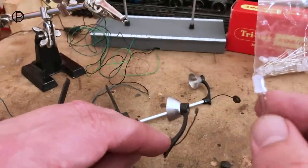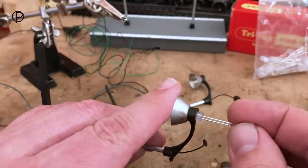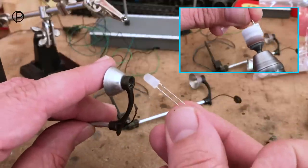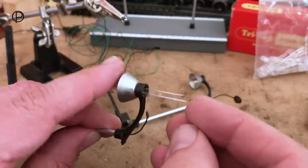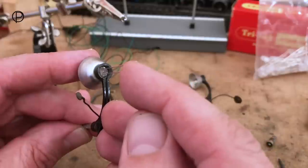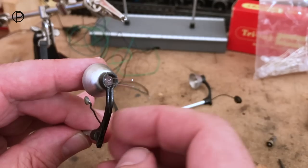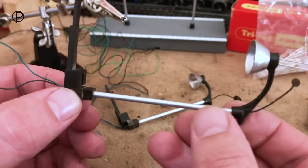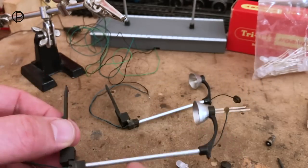The LEDs are little five-millimetre clear white ones — you could use cool or warm. When you push them in they don't quite fit, so you do have to do a little bit of work. I've used a rotary tool and taken a little bit off until they fit in nicely and snugly. Then we're going to cut these so we're able to solder the long positive leg, and we're going to bend the short one so it makes contact with the housing to get that return path all the way down the shaft to the green wire which makes contact with the long aluminium lamp post shaft.